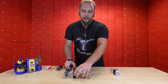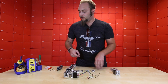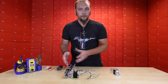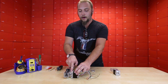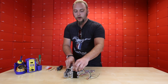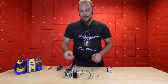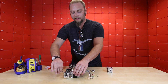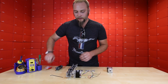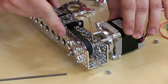I've taken our larger stepper motor and using this size bracket, I've connected it to this channel with some standoffs, and used a set screw shaft coupler to couple that to a drive shaft that'll go all the way through the channel. That way I can support it on the other side with a bearing block. I'm going to take this mount off the piece of channel to show you how the mount connects to the stepper motor. I'll then use a slightly smaller Allen wrench to disconnect the set screw on the coupler that has the stepper motor coupled to the drive shaft.